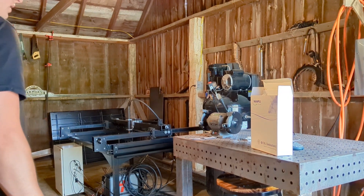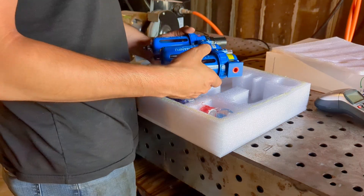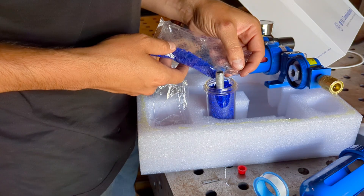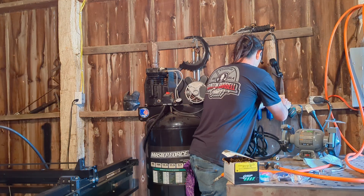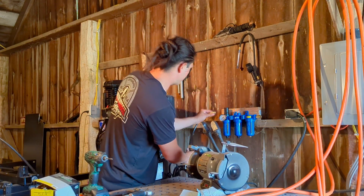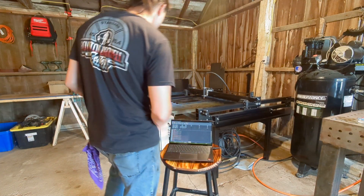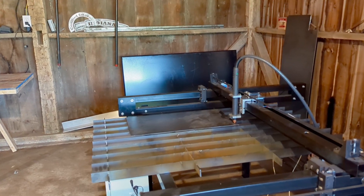Today I also have an air dryer. What the Hypertherm manual said is that one of the main causes for bad consumables is dirty or wet air. They had a few cheaper ones but I really didn't want to go cheaper — this one was about $120. Once I had the air dryer hooked up, it was time to give it the first official test run at the home shop, hopefully nothing got damaged during shipping.